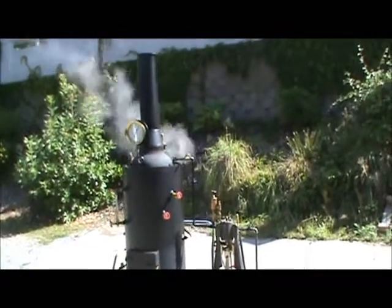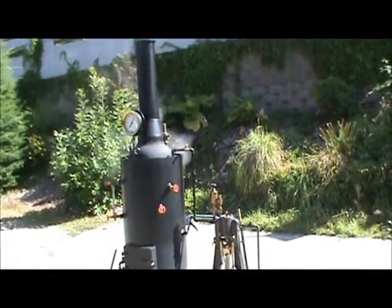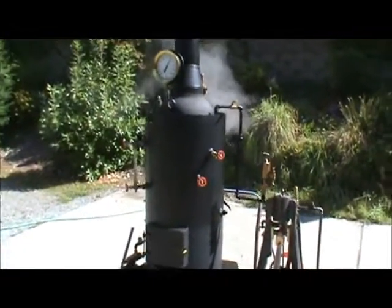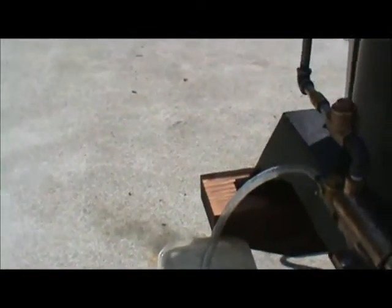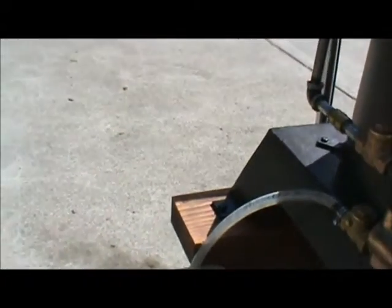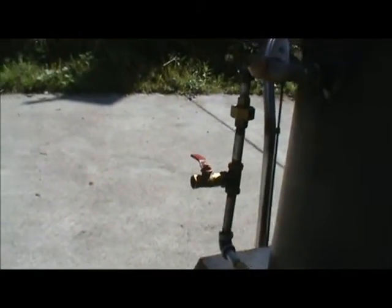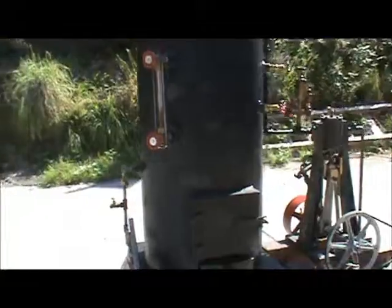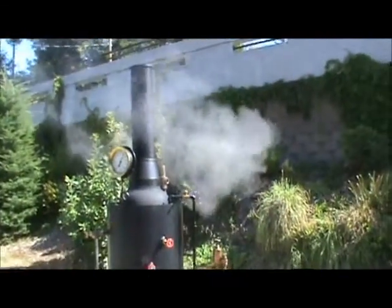You don't have to have it up to where it pops off — I just figured I'd show you that. You can run it at 45 pounds of pressure too. I've got the water pump going here. When you first start pumping, you're going to get an airlock because this tube is dry. So you open this valve right there, and right away you start seeing water coming up the tube. It'll start coming out the field, then you just close that off and everything you're pumping goes right into the boiler.